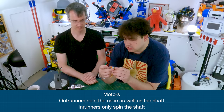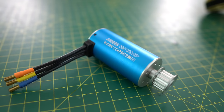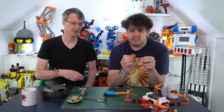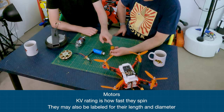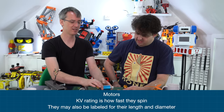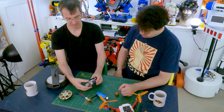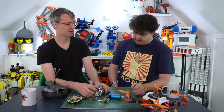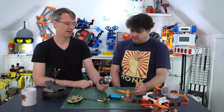This is an inrunner, which is inside-out basically - it turns like a traditional motor, still three phase. You'll notice it says 3674 on here - 74 long and 36 diameter, basically the motor size. Then you've got the KV rating: that one says 2200 KV and this one says 2250 KV - that's RPM per volt. These are quite high because it's a drone motor. For cars, you want a very fast motor and then lots of gearing to get lots of torque. This much bigger drone motor is a 6374 - 63 by 74 millimetres - but only 149 KV, because it's bigger and would have a much bigger rotor that needs to go slower.